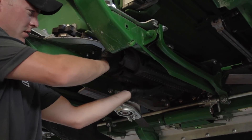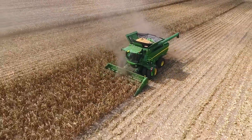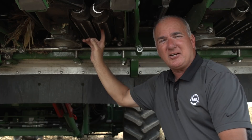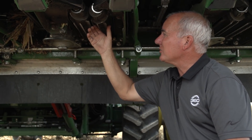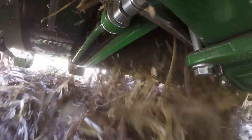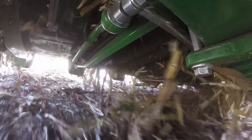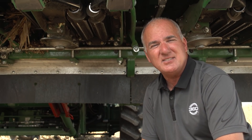The chain roll is designed for easy installation, and once it's on it's built to handle a lot of acres. In the last two years we still haven't reached the end of how many acres a chain roll can run - the most I've seen is 480 acres per row and they still had a lot of life left. They become razor sharp, pierce that stalk, grab it and chain it, and with two sets of knives coming around, every seven inches we create a piece.